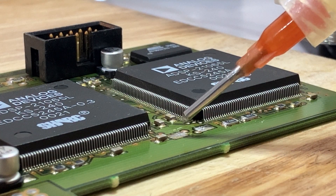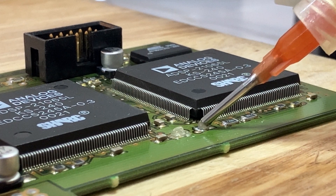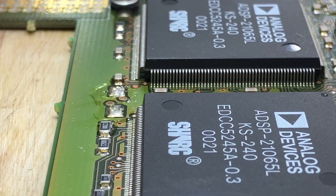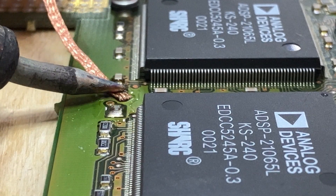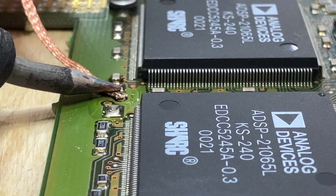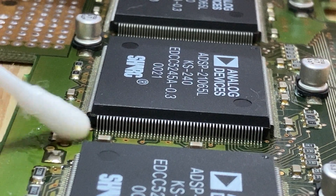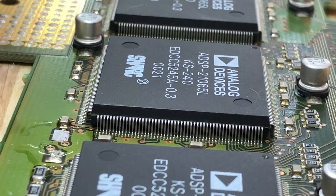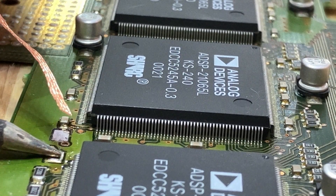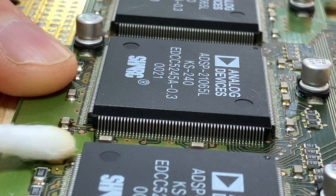The first thing I did was clean up the pad from the capacitor that had been knocked off. I added a little bit of liquid flux to the pads, then used copper braid and a soldering iron — look at my shaky hand, I'm very nervous doing this first one — and drew off the spare solder. Then with a cotton wool bud and some electrical solvent, I cleaned away the flux to reveal a nice clean pad ready for the fresh component. Same process on the second pad: copper braid to draw up the old solder, then electrical solvent on the cotton bud to clean away the flux.